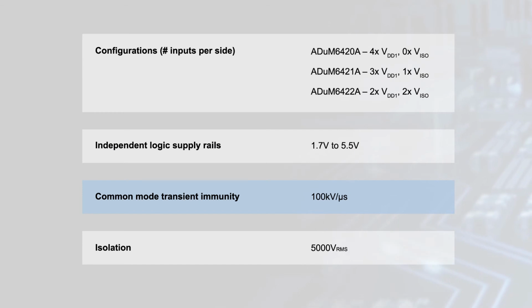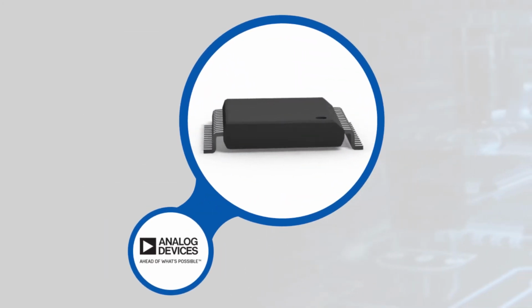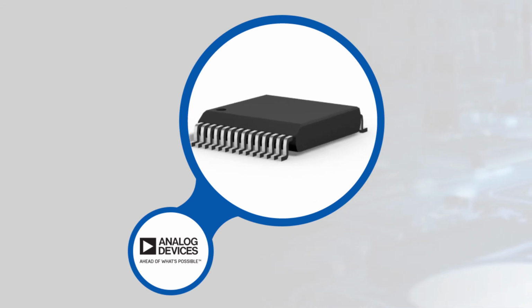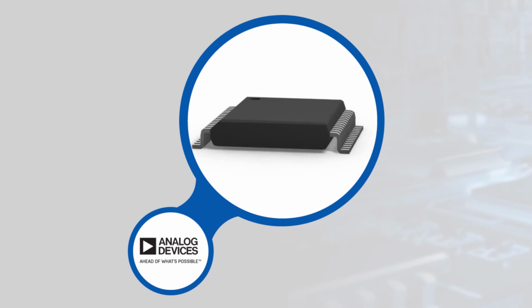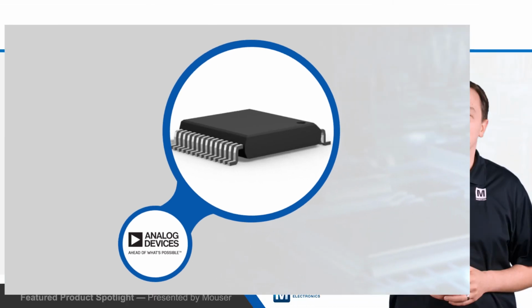The digital isolators are rated for 100 kilovolts per microsecond common mode transient immunity and 5,000 volts RMS isolation. The ADuM642xA series is housed in a 28-lead wide-body finer pitch SOIC package that provides 8.3 millimeters of creepage and clearance. The parts are rated for operation from -40 to +125 degrees Celsius.